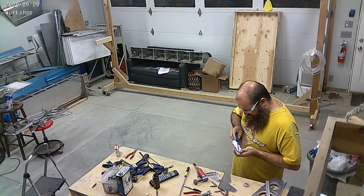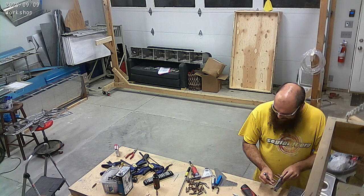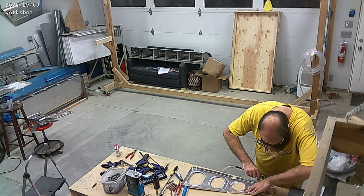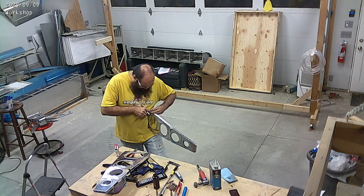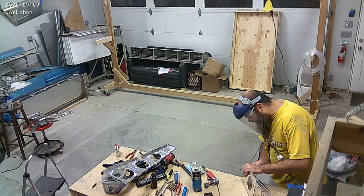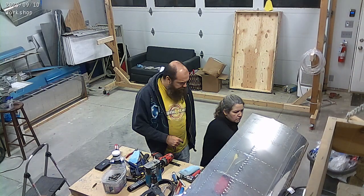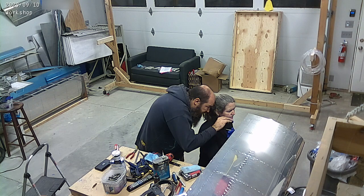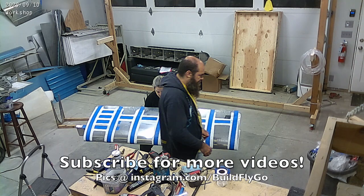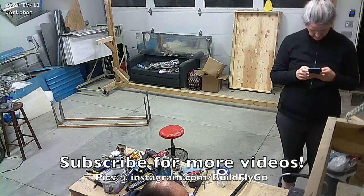I think Vans even mentions it. So we cleaned that up and added a bit more ProSeal over there — you can see the tank in the background. While everything cures up, I'm working on some more ribs. I believe it's 14 or 15 ribs per side. They get modified a bit, get brackets put on them, and there's a ton of deburring to do. We're putting the ProSeal on. These ribs take forever. And we're prepping the other tank to get the water put in.